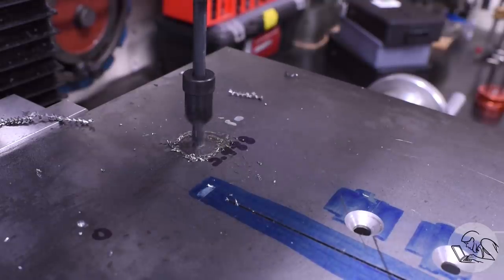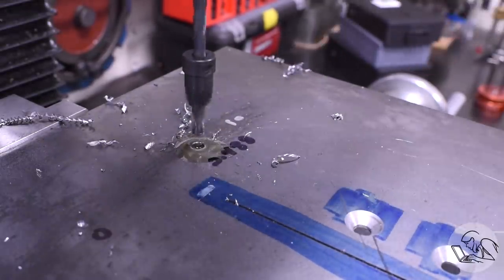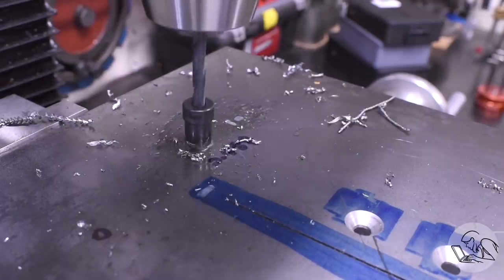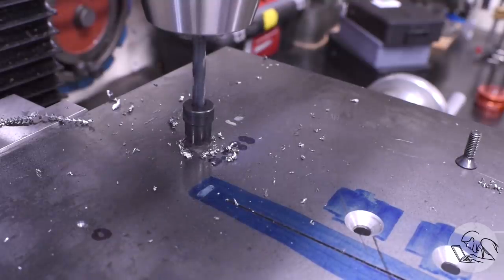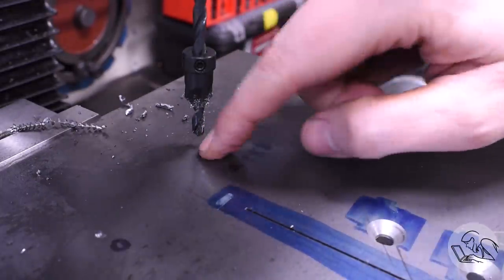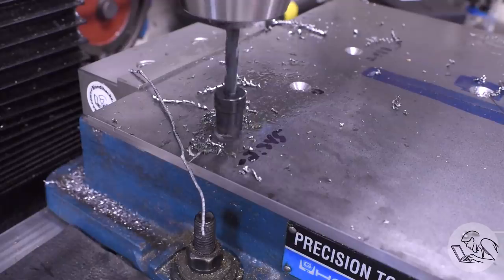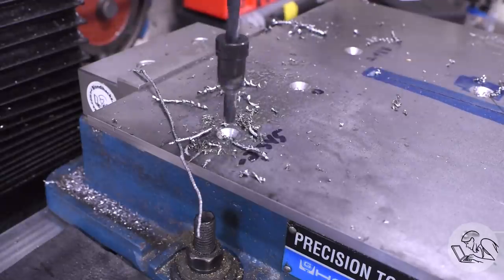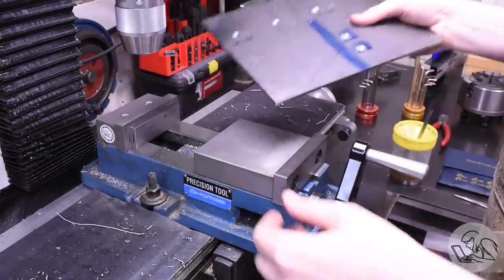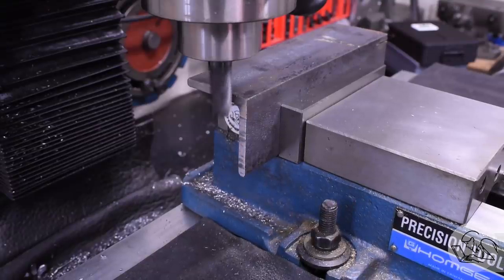I found this mangy old scrap here that will do the job, so I'm marking what looks like a good position for mounting that on the underside of the table, and I'm going to drill some mounting holes. Those get spotted and drilled through the clearance size for the mounting bolts. They need to be countersunk as well, and for this I have kind of a trick tool — a bolt-on countersink that goes on the clearance drill you're using for the bolts. I decided to give it a shot — drilled my clearance hole, slowed the mill way down to about 300 RPM, and fed it in nice and gently, and this thing cut like a champ. It's not exactly designed for metal application but run it slow and not too aggressive on the feed and it worked really well.